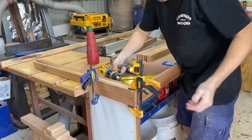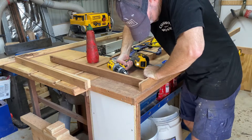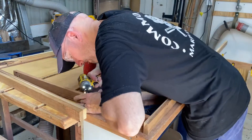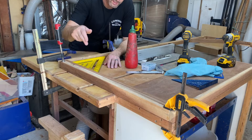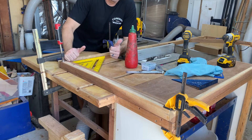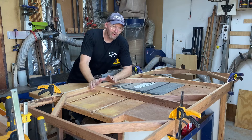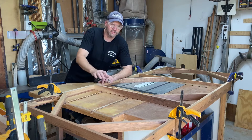Assembling the frame now. Many things need to be checked many times — check square, check square, check square, just in case. Pretty much every other time I put a screw in I throw down the set square and just check. This is the first corner so we need to get off to a good start. Just swung it round doing the other end now. That's the frame all knocked up — it's all pocket screws, normal screws, and just all glued together. That'll give this tabletop a little bit of structure.